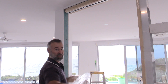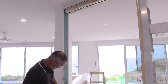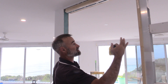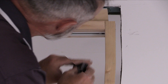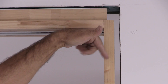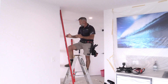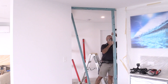The cavity's in. I've left the jamb out on this one - normally you'd build it with the jamb in place, but because we were tight on space I left it out. I've left 10mm on both sides - always leave 10mm inside of the jamb so you can pack it in and out. Now it's a matter of sliding some packers in behind here to get it tight against the jamb. Once that's tight, I'll work my way down to make sure this is nice and straight, then I'll get set up for this other little frame to divide off the cavity slider from the main room.